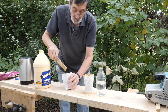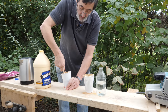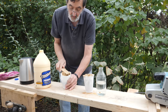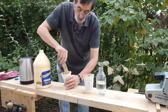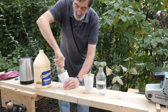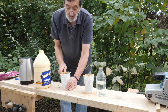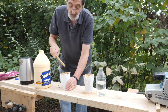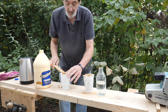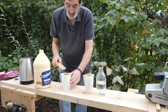There we are — I've got my medium oak filler. If you want it lighter, you can add another wood — you could add some pine if you wanted a light oak, and if you wanted a dark oak you could add some walnut sanding dust, very fine, maybe coming off your belt sander at 180 grit. My filler is ready to go, so I'll pop a plastic rubber glove over the top of it, and I'll do the same on the other one to see which one actually hardens up.